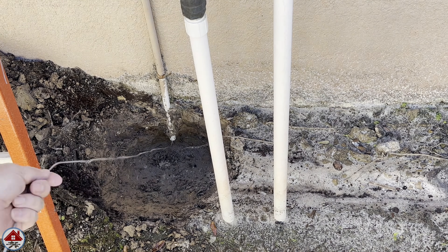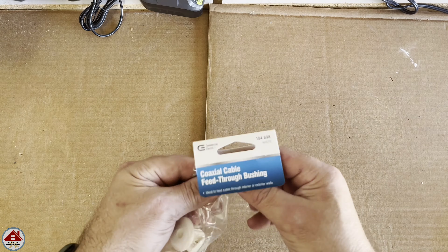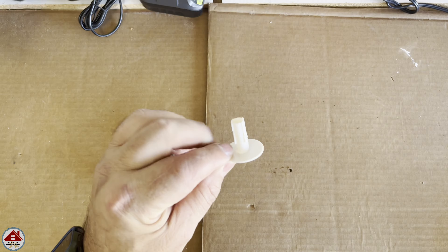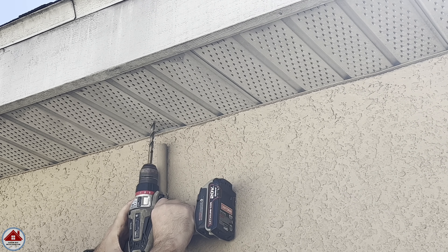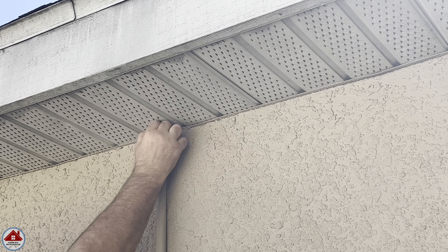To decide my next move, I attach my selfie stick to a PVC pipe so I can reach the edge of the roof to see what my possibilities are. I quickly realize the outer wall goes above the soffit and putting a 90 will not work. So instead I decided to use a feed-through bushing. I make my mark, drill a hole, and push it in the soffit to test the fit. This will protect the wire as it runs through the sharp metal soffit. Next I feed my fish tape through the soffit straight in the direction I left the wire and place the housing wedged between the wall and the conduit.